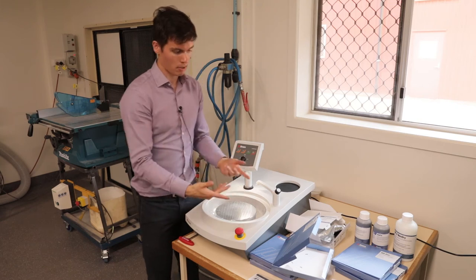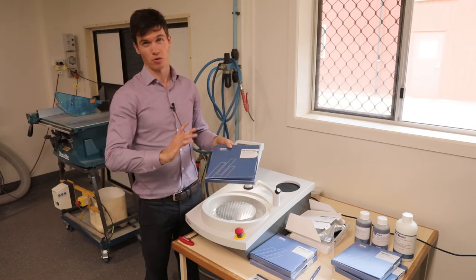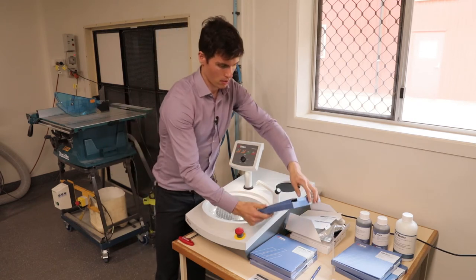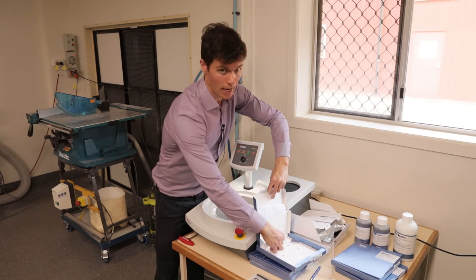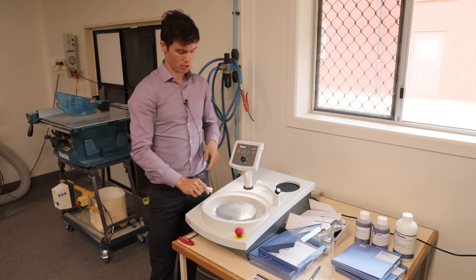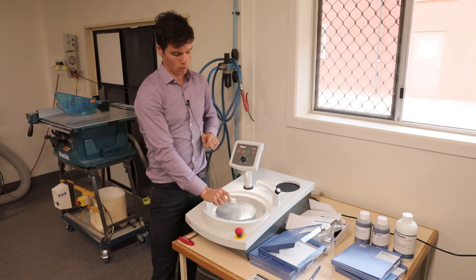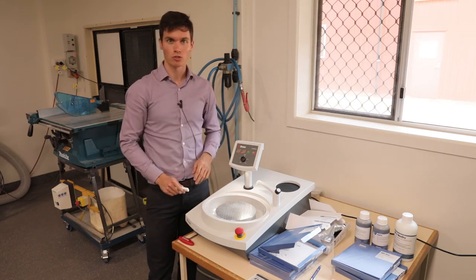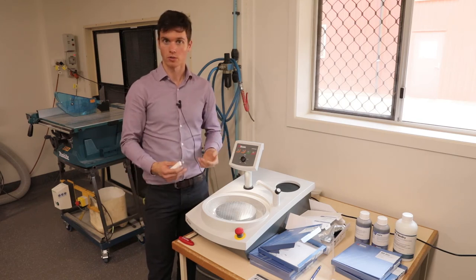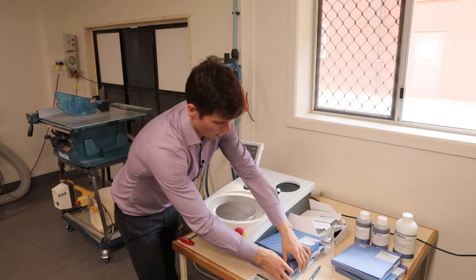The MD Primo is specifically for slightly softer materials — from 40 to 250 Vickers. If you use it every day, probably once a week you should clean it using the included aluminum oxide bar. Essentially, turn the machine on and move the bar back and forth for only about 15 seconds, running water at the same time, to remove any debris. That's one of the grinding steps.